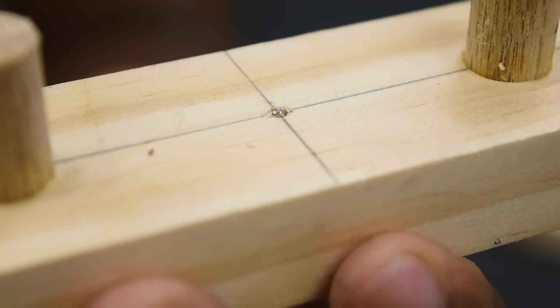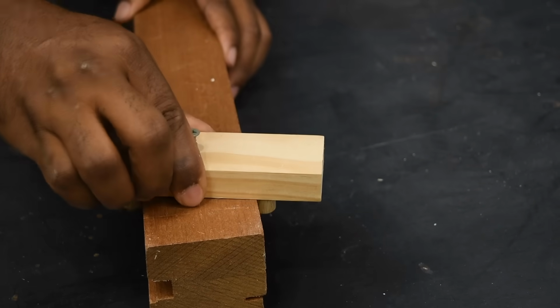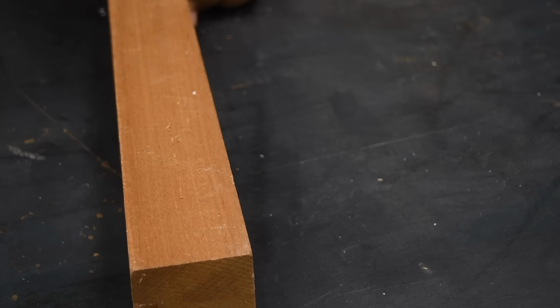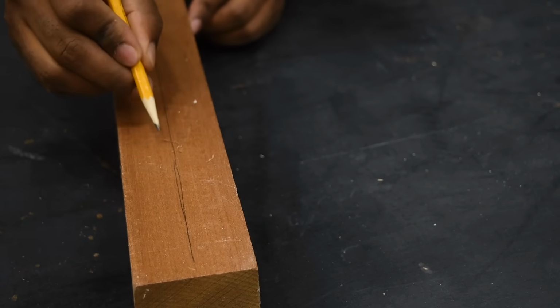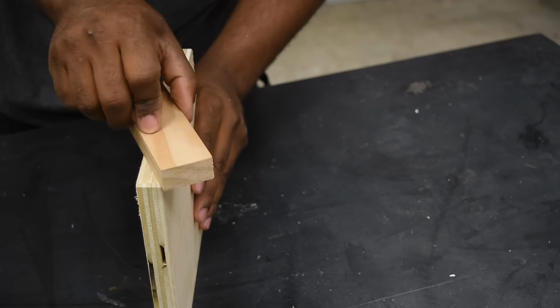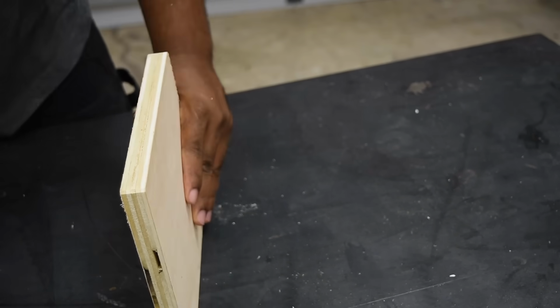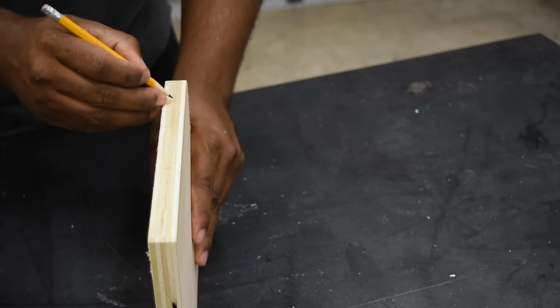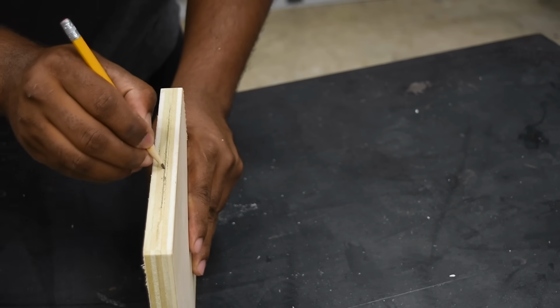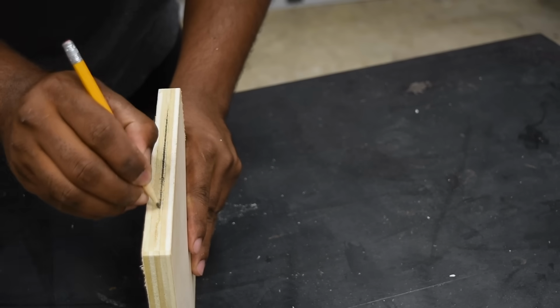Now, one of the upsides of this being a screw is you can adjust the depth of your scribe. So the more it protrudes, the deeper the cut, and could also mean a little harder to drag, but you will get a deeper cut, and you can always back it out so that you barely score the surface. As shown, this can mark multiple sides of materials. As long as you have a parallel line going down on both sides, you get that straight line going right down the center.